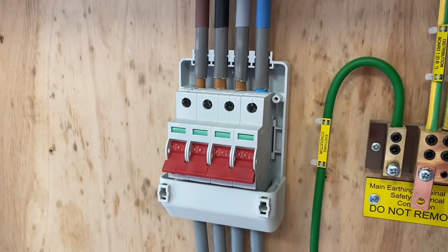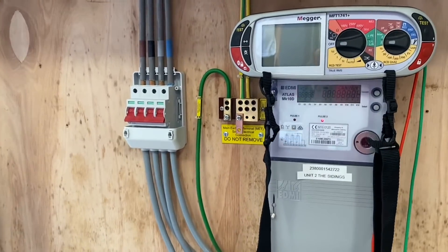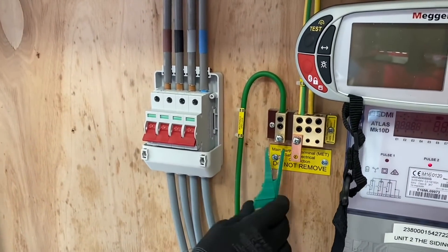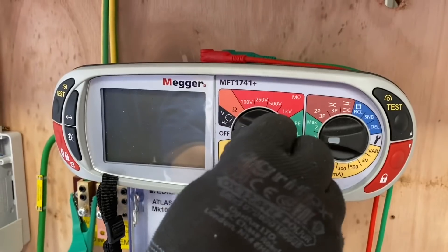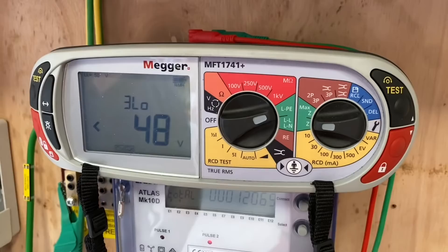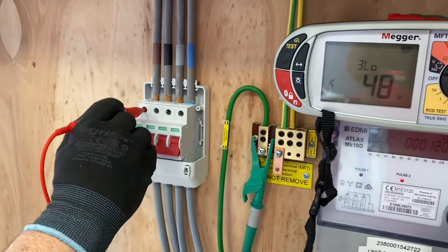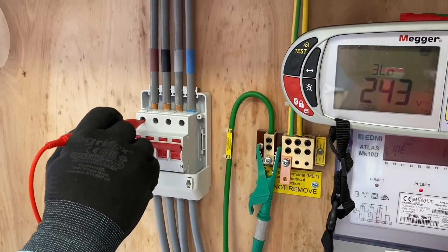That's probably what you might do on AM2, AM2S, and AM2E, but we're going to connect between our disconnected earthing conductor and our lines. Of the three readings we get, which one will we record? We'll be recording the highest one. So we're going to probe in the safest possible manner — we're going to clip onto our earthing conductor first. We're currently off because the isolating switch is off. Then our machine needs to be turned on; on this meter we go to LPE first — that's Line to Protective Earth — and we're going to measure between L1 first.